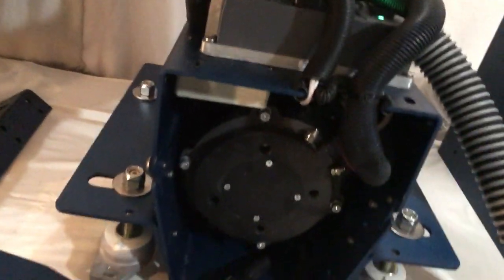The SPOW fan puts out a lot of air. These fans can be push fans or pull fans. If they're pull fans, you'll be pulling air through the air intake up here. If they're push fans, you'll be pushing air out the air intake. If you have a dry bilge and you want to use the heat from the motor to heat your cabin, you can push the air into the cabin. If you have a wet bilge and you want to use dry air to cool the motor, you can pull nice dry air out of the cabin.